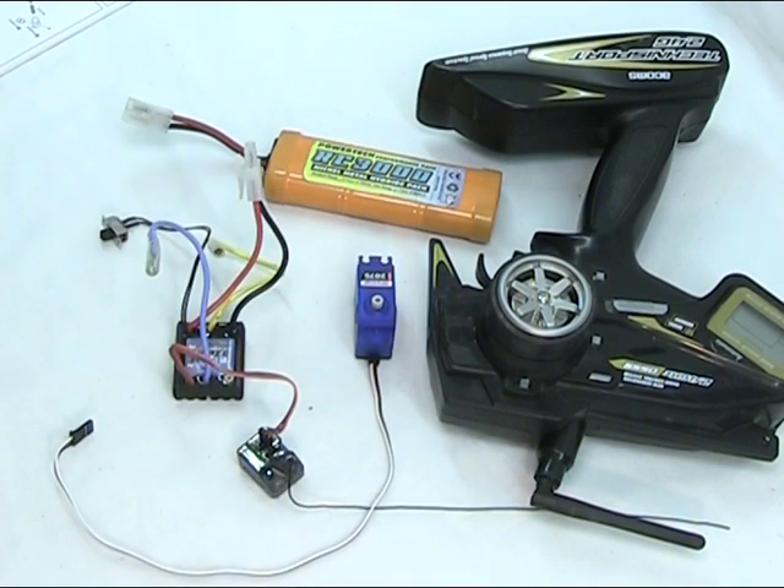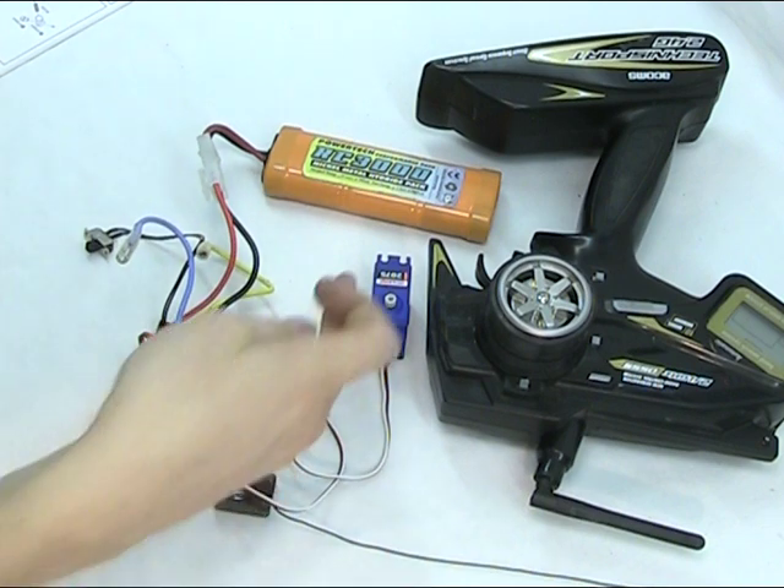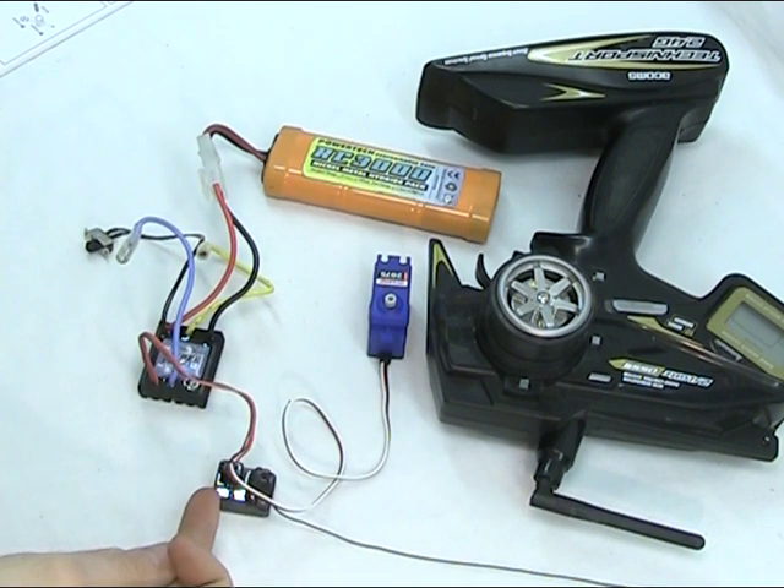You can't interchange those wires if you want the servo to reverse — you'd need a much more capable electronic speed controller. I've now finished connecting my servo into the receiver, and then connected my battery to the electronic speed controller. You'll notice there is no motor at this point — when we set the servo up, we don't want the motor to be running. I'm not going to show you how to bind the receiver to the transmitter at this point, just purely show you setting the servo.